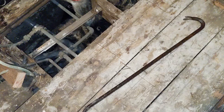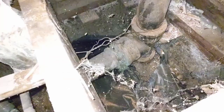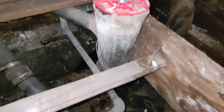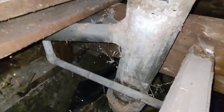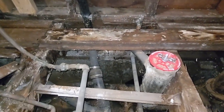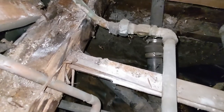In addition, there's this plate of tin or steel — it's really thin, but it was covering up a third hole. As I pulled out the rest of that hardwood, this one — the hole actually goes through the hardwood and the subfloor. So we're finally down to the last layer, these boards that are the final subfloor, and we get to expose my plumbing, which I've only ever seen from underneath. My coat hanger style contraption holding the vent to the toilet drain — or the toilet drain to the vent, I'm not sure. Looks like some sort of oakum repair on the outside of the cast, which is weird. I'm guessing this is lead or that cardboard-style pipe that was popular back then, because it's kind of flaking off near the top. It has this offshoot, and I never was really sure what this was — my guess was a vent at one time, because of the notch cut out in the wood there, but that's been capped off.